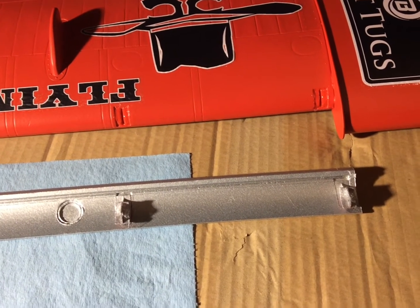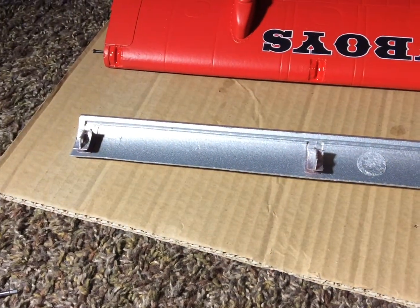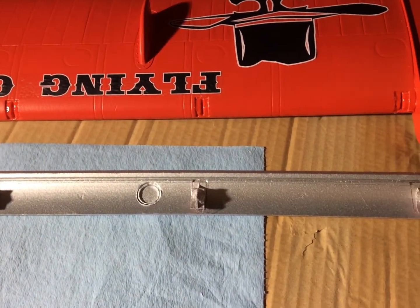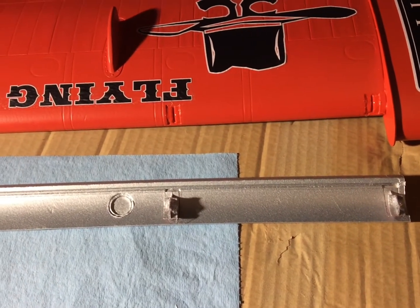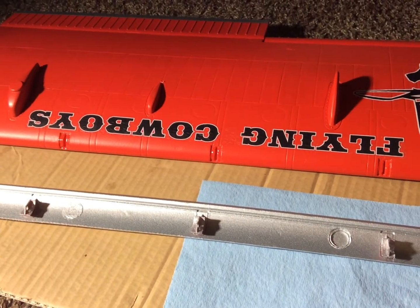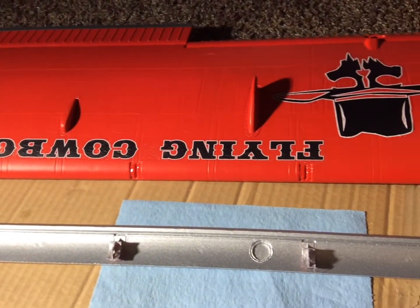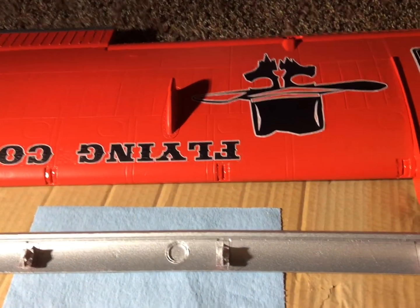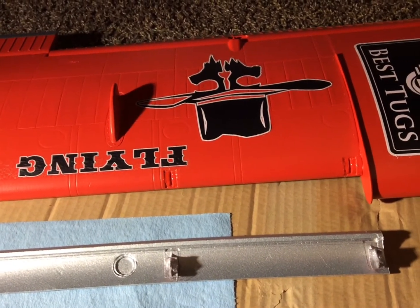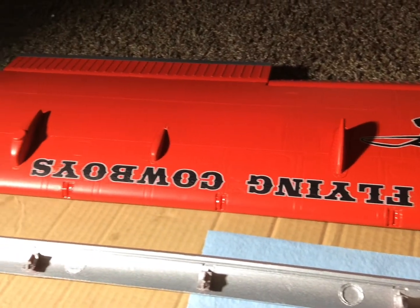So there we go. We have our glue on both sides of the 2 pieces that we're going to work on. Now we're just letting them sit for a couple of minutes, 1.5 minutes, 2 minutes, and then we'll stick them together. How long should you leave it? 1 minute, 2 minutes, depends on how much heat in the areas you're working on a hot day. It might be less time on a cooler day in your basement. Maybe it's going to be a little more time. As long as they hold together when you stick them, it's going to be good.